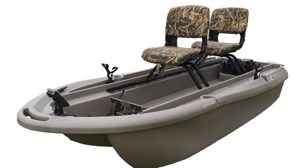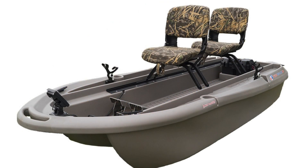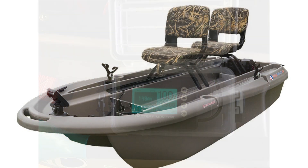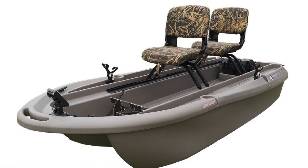I built a 150-amp battery using 24 Navitas cells purchased from Battery Hookup in Pennsylvania. The cells cost $313 including shipping. I decided not to install a BMS, so I had to add charging leads for balanced charging. I used the iCharger S6 with a 24-volt DIY power supply for charging. I also installed a battery monitor that tells me exactly how much power is left on the battery when I'm in the water. Patrick, when you see this video, please answer below — I have a question about your battery monitor, since voltage alone isn't a very accurate way to predict remaining power, yet your monitor gives actual percentages.